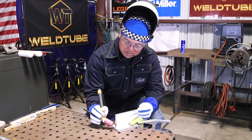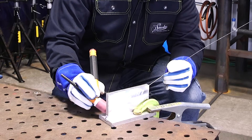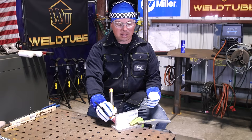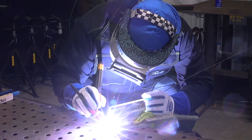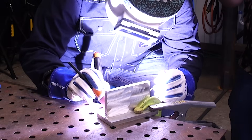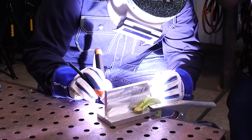I'm going to go ahead and get ready to weld up this T-joint here, and just be walking just like you would a carbon steel or stainless steel T-joint. The only thing that's going to be different is the way I have to feed the filler metal. I kind of will have to dab and push. It's not going to be kind of a constant puddle like the other alloys. So I'm going to go ahead and start right here. Once the arc starts, you're going to have to heat up the plate a little bit for that puddle to start turning shiny. Once it starts turning shiny, then we're going to start adding filler metal — walk, normal rocking motion. We do have the cup resting against the bottom plate and the vertical plate. Just rest against it and start moving, rocking, steady motion, moving forward. Just making sure you're fusing both ends and putting metal evenly on both the bottom plate and the top joint.